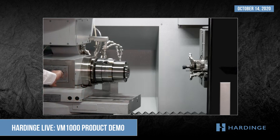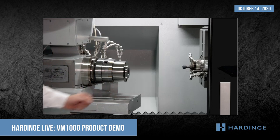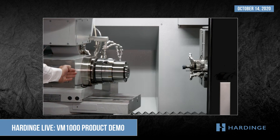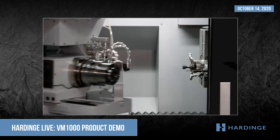As you can see, the workhead is arranged on a table profile and can be adjusted to the workpiece dimension and length. It allows also to place steady rests on the table to support sensitive workpieces. It allows also to clamp and unclamp the two sizes of workheads easily. As you can see, the B2 axis supports us also to orient the workpiece in different positions, especially to grind cones directly under the B2 angle. Now to another highlight of the VOUMARD 1000 machine, the dresser positioning.